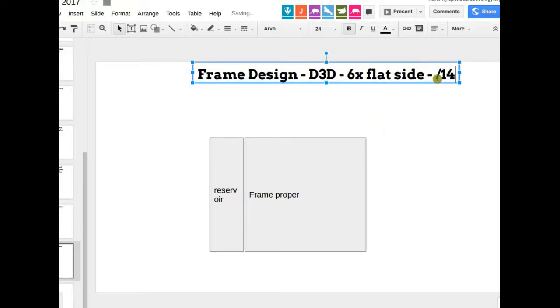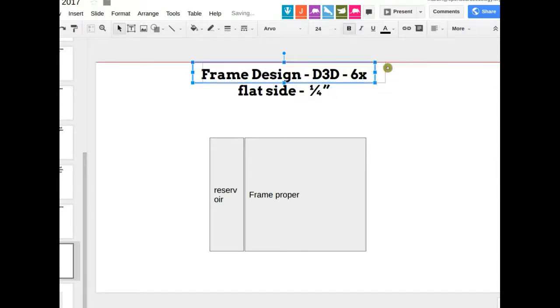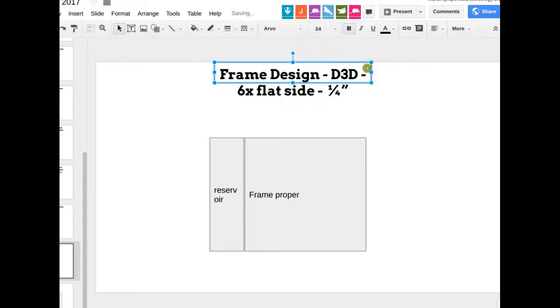Using here in this case, we want to use a quarter inch steel as opposed to eighth inch, because quarter inch is going to be stronger for a power cube, which is going to end up weighing a few hundred pounds, 100, 200 kilos maybe, 100 for the light one. If it's a single one, the master one's probably going to be like 250 pounds. Maybe the slave power cubes might be like 200 pounds or something. So quite human handleable. The engine itself is about 100 pounds. So everything else around it is going to add probably another 100.